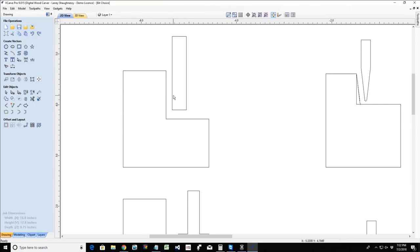And so I just have to remember that, depending on what I'm doing, especially if I'm using plywood or something, then I'm definitely going to use a down cut spiral, because I do not want the top surface of that veneer of that plywood to chip. So I'm going to use a down cut spiral.